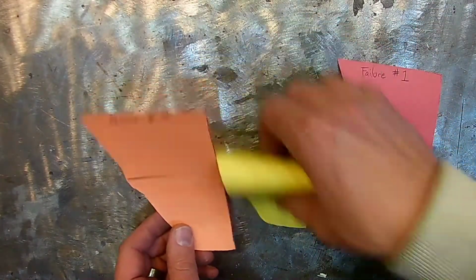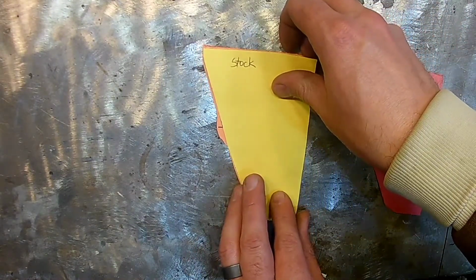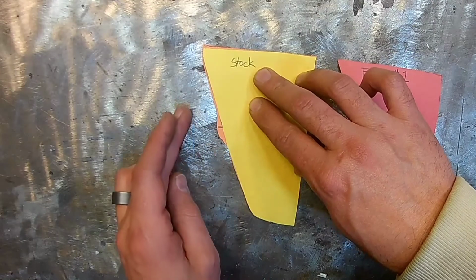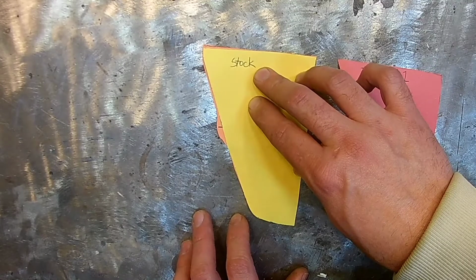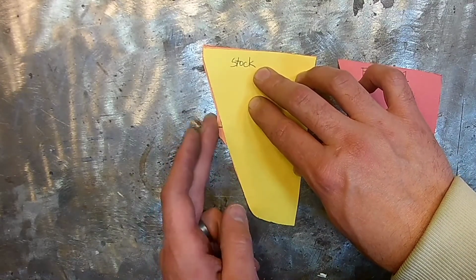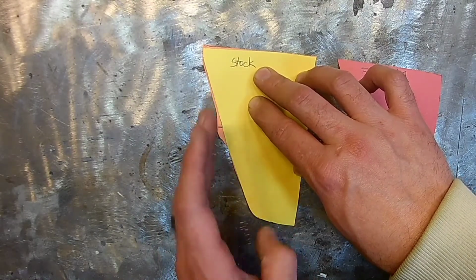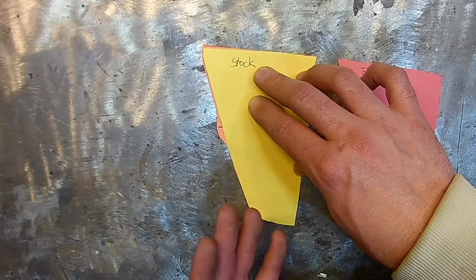When I did the second one, I ended up here. So I ended up with this big bulge you can see in the orange here. I was checking the flatness with just the tip of a flat hammer, but for whatever reason, I was just checking how well they were touching across here, not even noticing that I'd actually created this giant bulge. So that's why I had to cut it apart again.